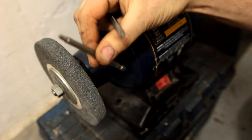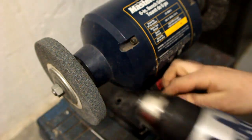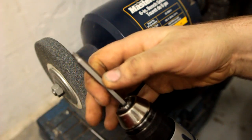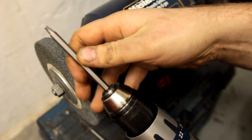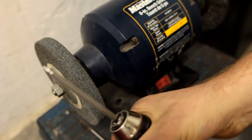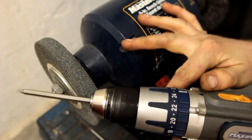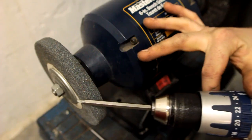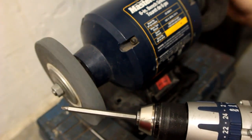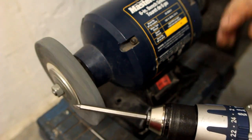The way I'm going to do this is by taking the screwdriver bit and putting it in a drill chuck — not far in, just far enough to get a good grip. Then, while I'm turning it, I'm going to move it back and forth along the grinding wheel while the grinder is on. I'm explaining it now first and then we'll get to the grinding in a minute.